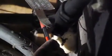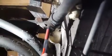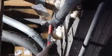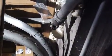Every home in the United States requires to have a ground like this, or another ground, which I will show you in a few minutes. The primary components include this clamping device that I am touching with my pen, then the bonding strap, which is right along here, and that bonding strap must be connected back then to the conduit, which goes back to the electrical system. This is our conduit. Without this, there can be electrical current running around the building that could electrocute somebody under unique conditions.